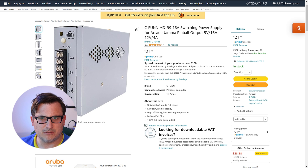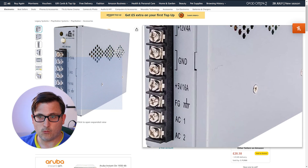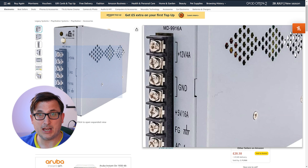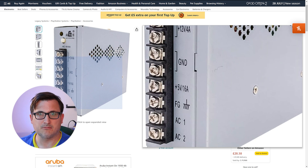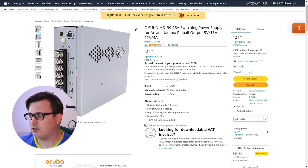We're building our list — it's a lot more expensive than I thought. We need something inside the machine to power it. The Raspberry Pi has its own power situation I'll have to work out. I found this arcade power supply on Amazon which outputs the voltages we need to plug into the JAMMA harness — 12 volts, ground, 5 volts. It takes 240 volts AC and converts it down. That's pretty reasonable at £22.